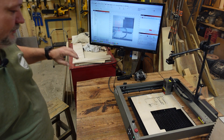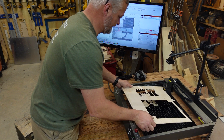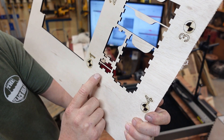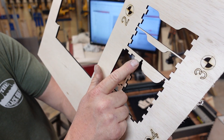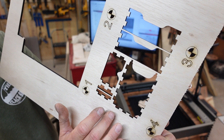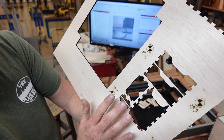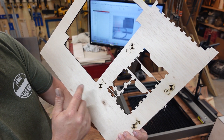And there we go - all the pieces are done. I'm going to pull this material out, get these pieces to fall, and turn it around to let you guys see the back side. There's no scorching - it's doing a really good job at mitigating that flashback scorch around the cut. There's also no soot or discoloring like you would see a lot of times with other methods. Now I'm going to show you what happens if you don't have proper ventilation underneath your workpiece - I'm going to put a piece of metal down here and cut on top of it.